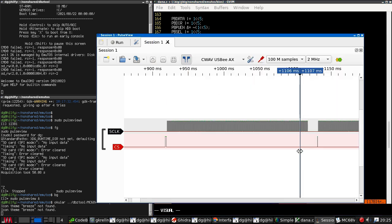And that brings me to the second interesting thing I discovered, which is that the pins in the SD card interface are devastatingly fragile. By plugging the logic analyzer into them, I actually bent some of them. And as a result, the slot is not working very well. I've attempted to bend them back again, but I will have to pause periodically to make sure that they're all still making contact. So I've had to use a different hookup strategy, and I only have 2 available data lines that I can connect up, which doesn't involve connecting to the SD card pins. So here they are, currently connected to S-Clock and Chip Select.